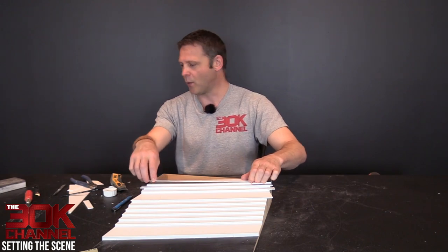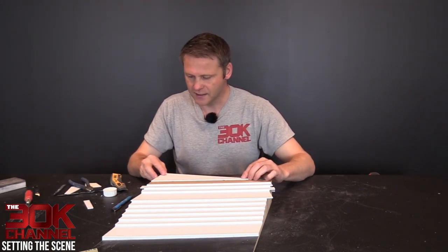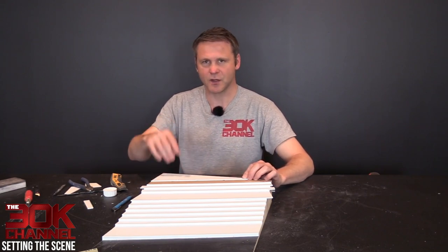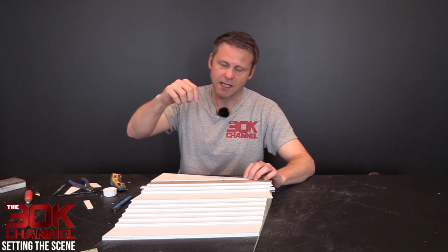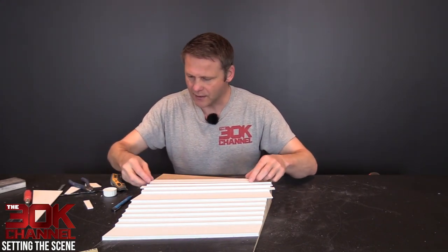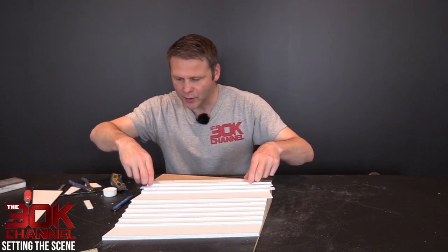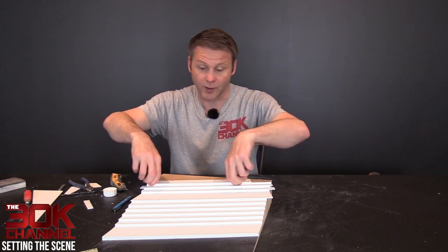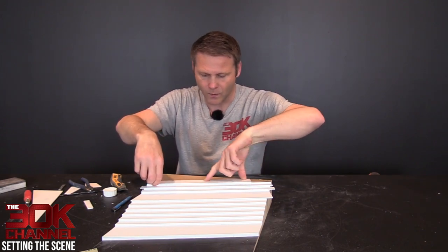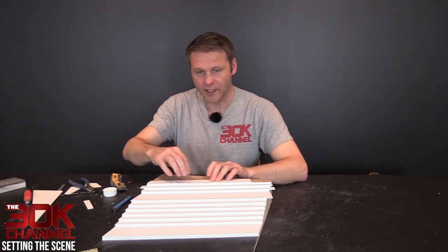And then what I'll do is I'll also transfer them onto this side after I've cut my design into this, because I don't want the machine to get interfered with those holes. So it's really important that we do that after. I'm sure it'll be fine, but I'm just trying to be cautious because I do not want to break a drill bit on my CNC because they are quite expensive. So I'm going to flog these holes out and then we'll glue it down.